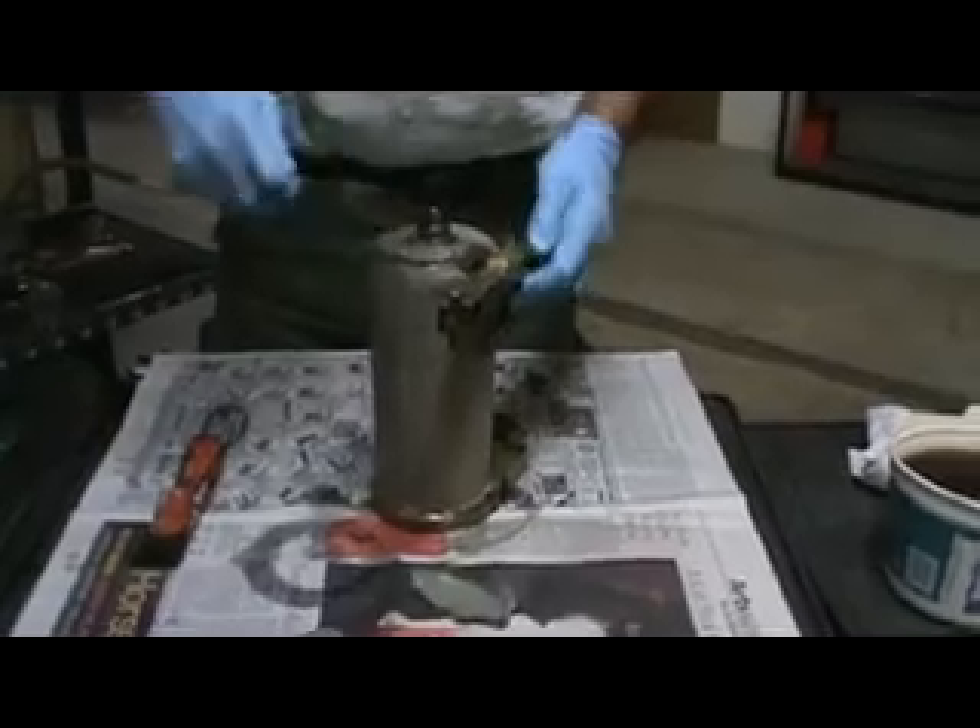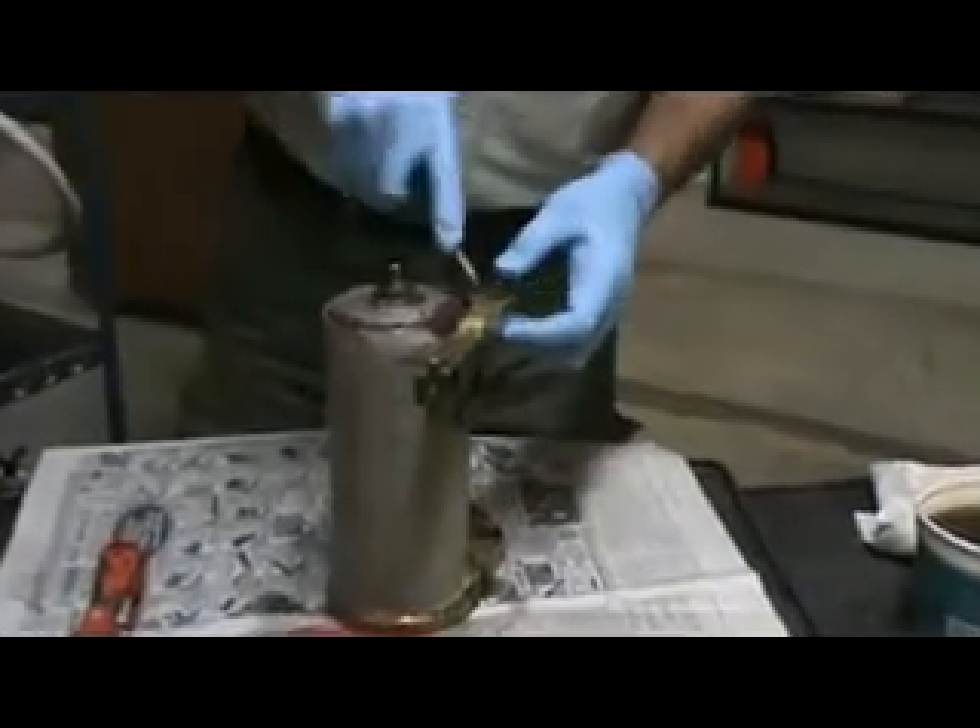You'll see very simply that once it's wet, you just come in here and it falls right off. This is the part that was hollow up around the top. I just take an old used work knife — you'll see it's a bit aesthetically challenged — and peel this off just like this. Note here the soldering on top of the boiler. The new boilers they make for the new Cremina are just absolutely beautiful, perfect stainless steel. But of course that's on the new models. This one is 1983, the last year that any of these had this really thick coating.